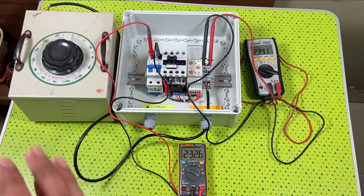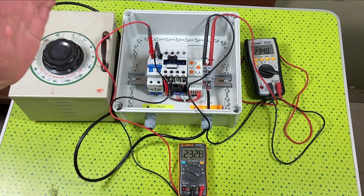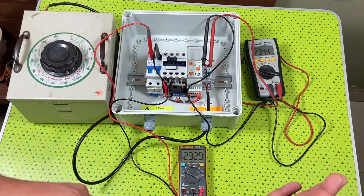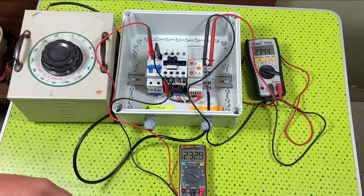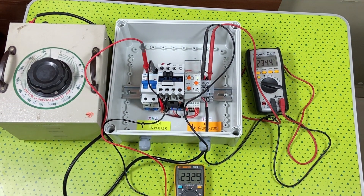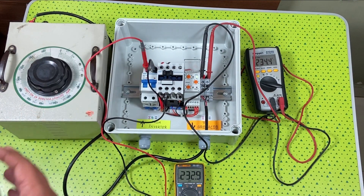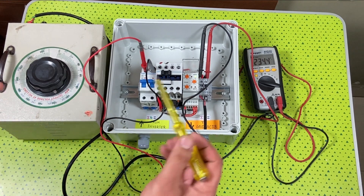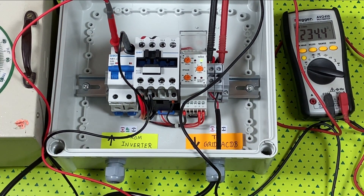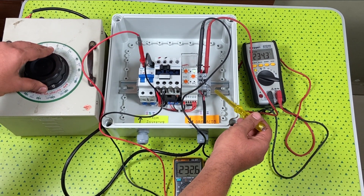We just saw level 1 of protections which was put below the solar panels. We have put up the same box here on the test bench. The idea of this level 1 protection box is to isolate our microinverters in case there is an excess voltage or under voltage from the power utility grid. This box consists of our MCB, a relay, and a contactor. The output from the microinverters comes into this MCB, and through these terminals we have connected the output to the ACDB box near the electricity meter. To simulate the grid, we have used a variable transformer.